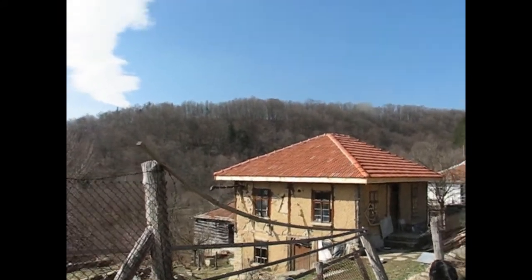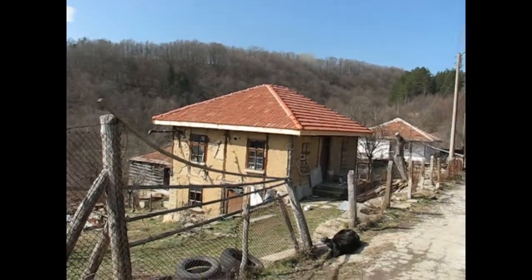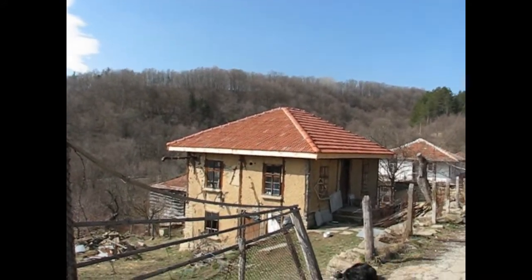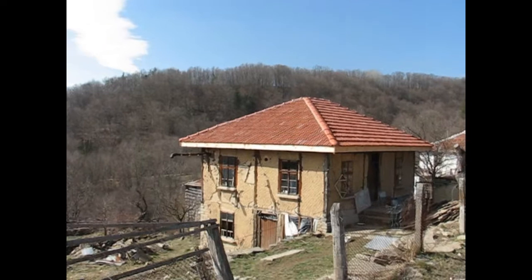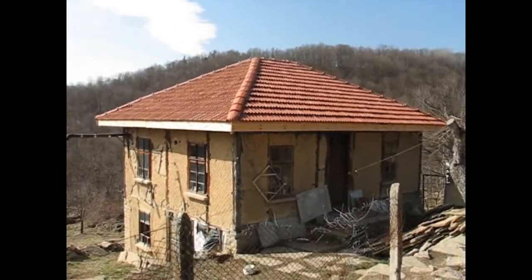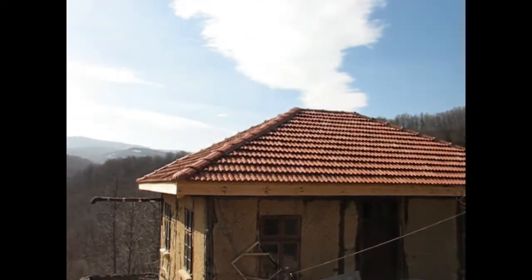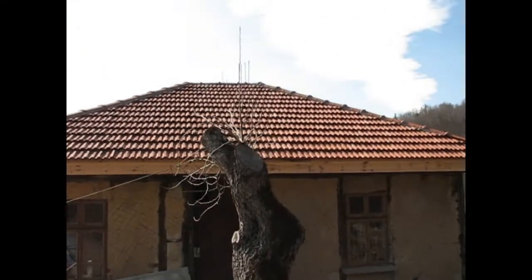This roof has been built last year — I put it on. Everything is brand new. The tiles are second-hand but really good tiles. Basically what you want to do is start off by walking around the roof. If the roof had gutters and a chimney, then they would be inspected too. This roof is still in construction, so there's no gutters to inspect. From the bottom we'll just look at the ledges, the ridge and the hips, make sure everything is cemented nicely, look for any broken tiles, and try to find any problems.